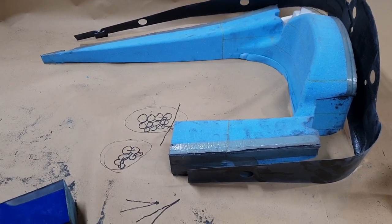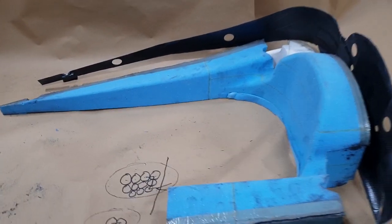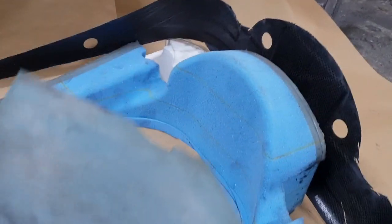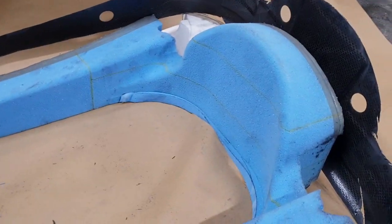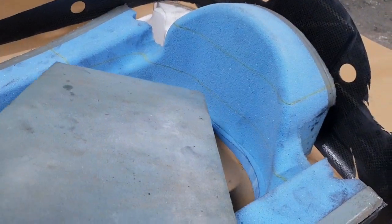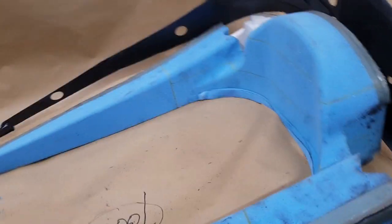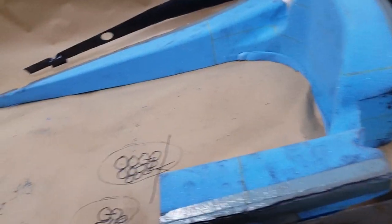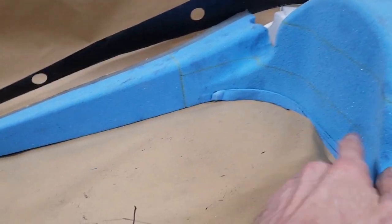But getting back to the foam structure we have in front of us. So this was made, as I said, from 70mm thick foam. You buy it like this, 70mm thick, and you can probably see there this was made from layups of 70mm, 3 pieces bonded together and then machined. Now obviously if you don't have a foam the right size, you can join it together, which these have done here. There's a glue line there, there.